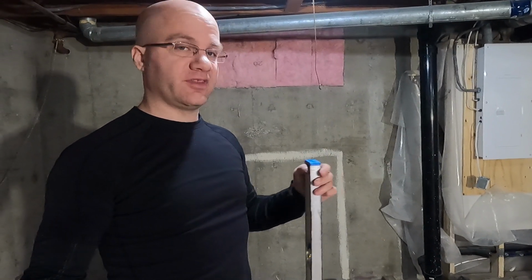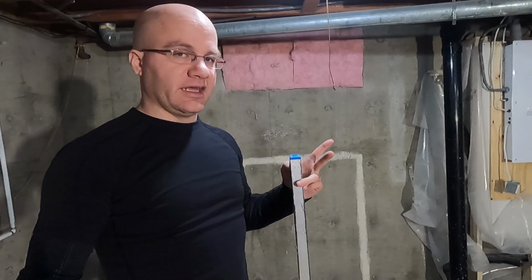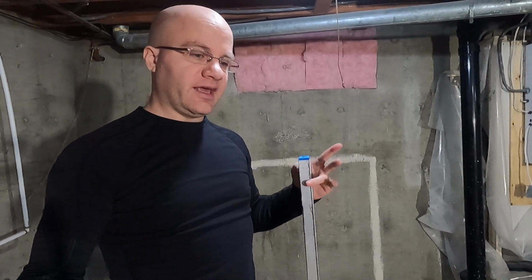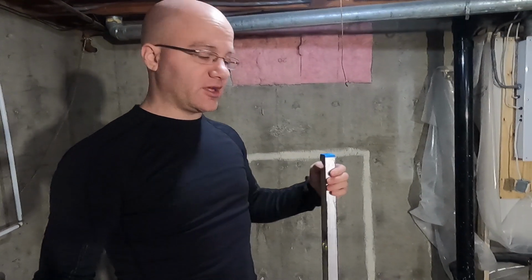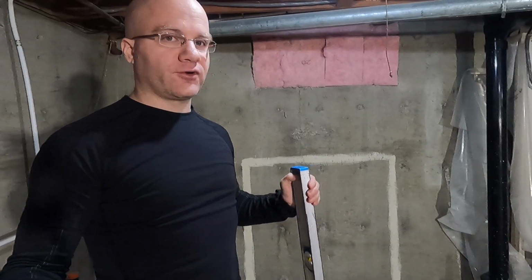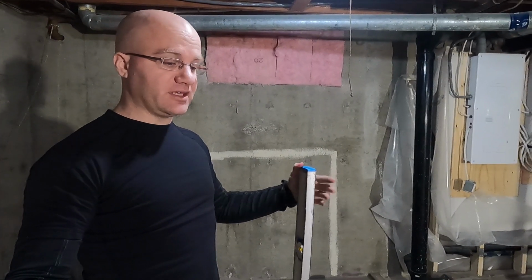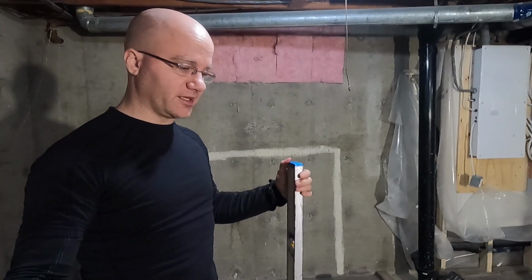If I was going to do it again, the two main things I would say is definitely more water, even more than the 100 milliliters that we added on top of the maximum that it suggested. And I would do more screws, but I would also do more screws in a consistent pattern. There were a lot of times I found myself squeegeeing and rolling and looking for where's the screw and not necessarily able to find one. And I think that led me to overworking the material a little bit.